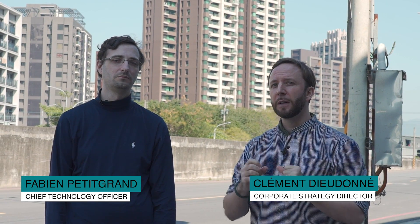The field trip continues to a site where we have just installed the DCU that we discussed before. There are a number of challenges when it comes to installing DCUs, and we as a telecom operator for Taiwan Power have that experience, because we have to do this particularly in an area like this one here, where the meters are in an overall residential area including basements and a number of apartment floors, which makes it difficult to just install the DCU on top of the building.